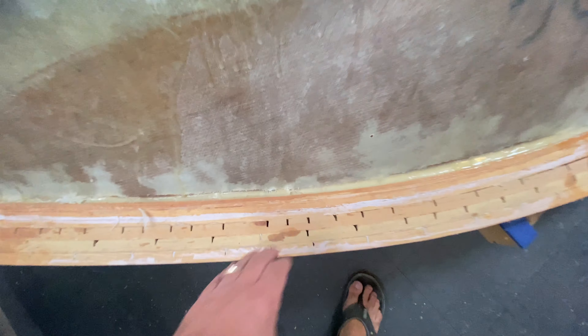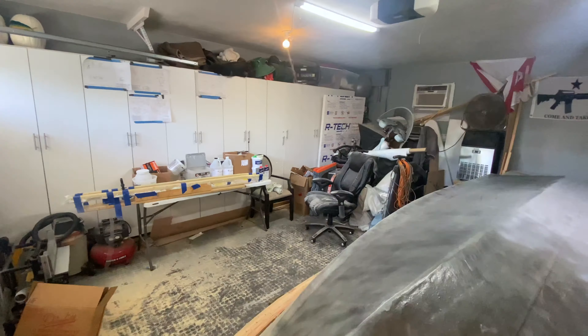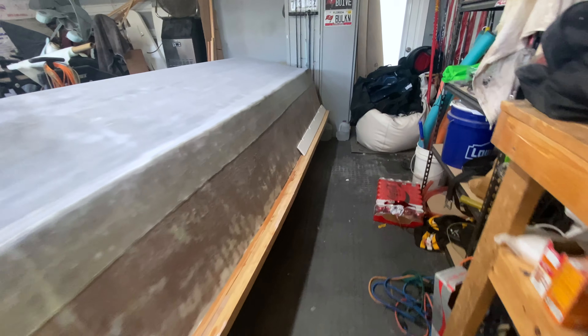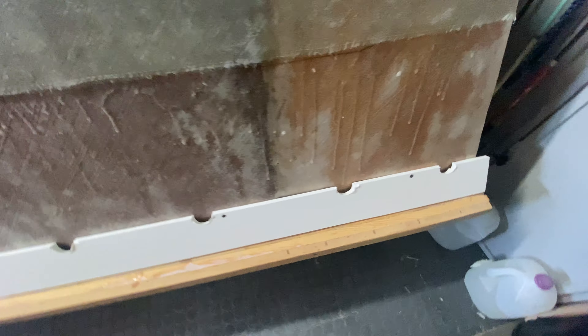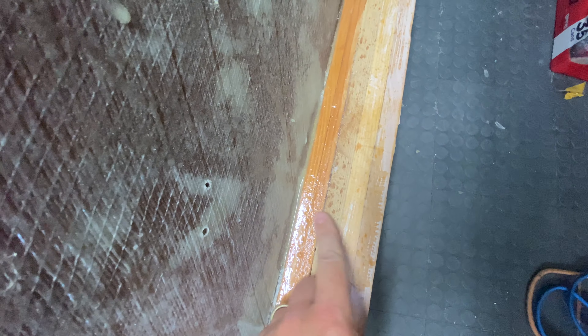Between my spray rail I've got a little gap right here, and I don't want the hull to transition at such a sharp angle. So I picked up some more pour foam and made this little foam jig — basically that's the angle I want coming off the transom to the spray rails. I'm going to pour foam inside all these little notches I cut out. It's screwed to the hull on a plastic board so it shouldn't stick to the foam, and it's going to cover up these two boards while still leaving me rail to work with.